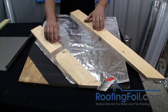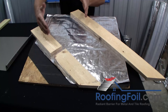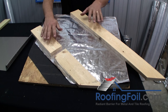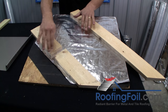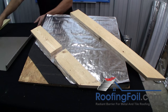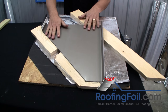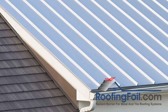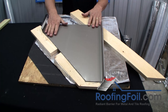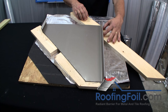Another method that's rapidly gaining popularity is the angled batten or slat version. The battens are installed at a 45 degree angle on the roof and you leave an inch or two gap between each one. This allows a ventilation path between the battens and underneath the roof from the drip edge all the way up to the ridge. This works best with standing seam metal roofs, installed directly on top of the battens — typically one by fours installed anywhere between 10 and 16 inches apart depending on the gauge of the metal, which have a lot of surface area to attach the clips onto.